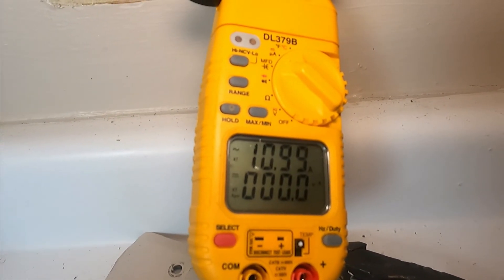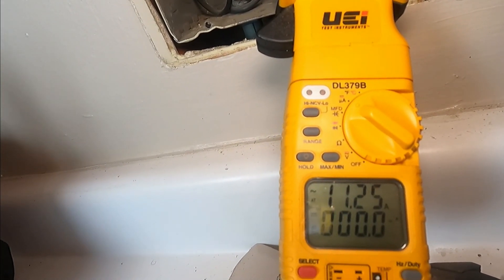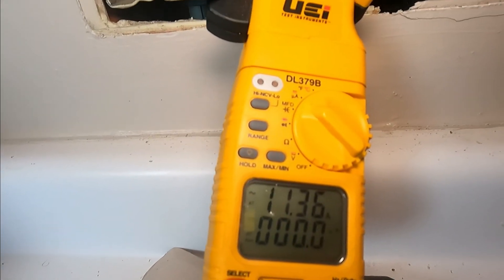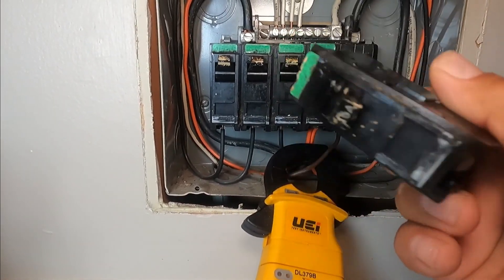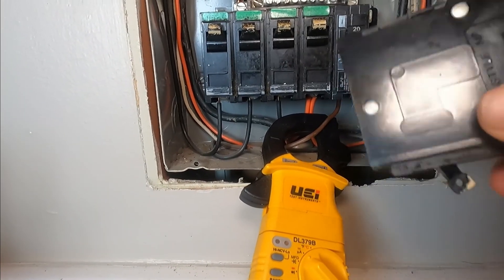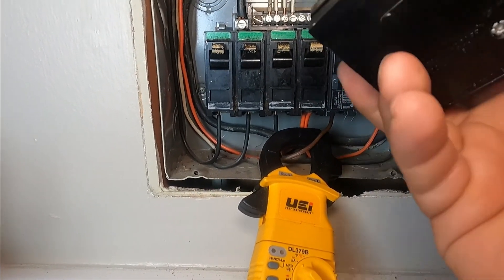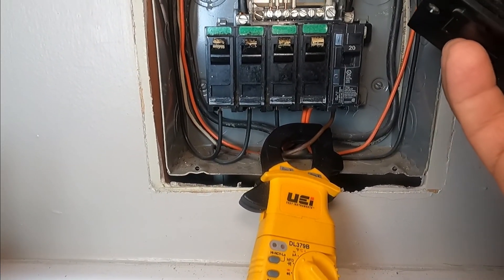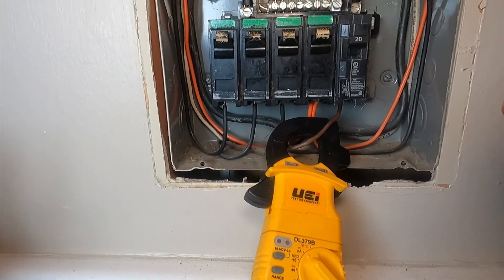It's picking up to about 12 amps — it's supposed to be 11.5. With a 15 amp breaker you're supposed to run at 80% of capacity, which is about 12 amps. So it was right on the borderline. It's an old breaker, the filter is a little dirty, and it's only 15 amp — altogether those factors were tripping the breaker.